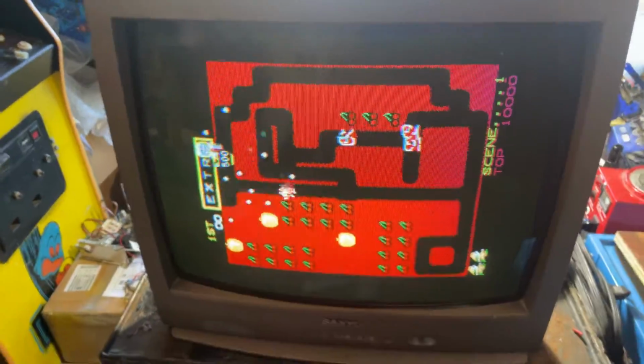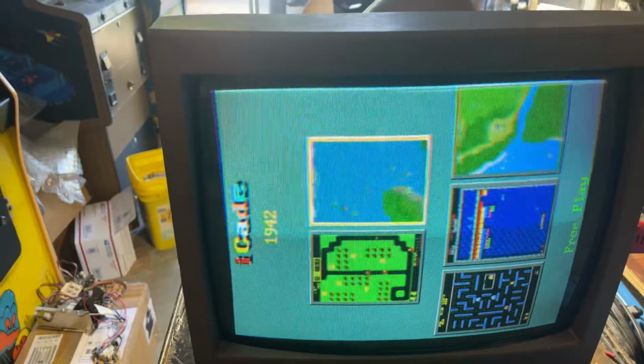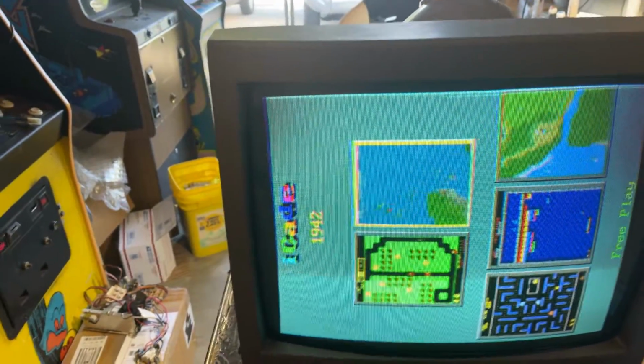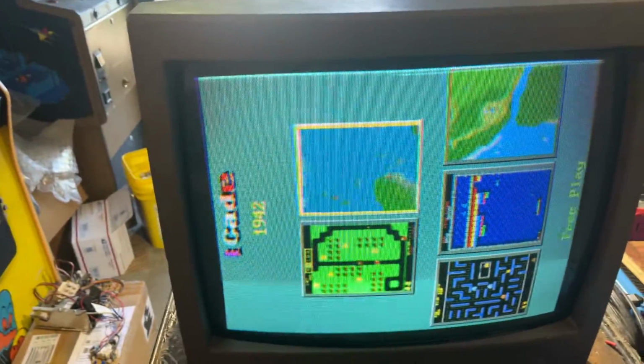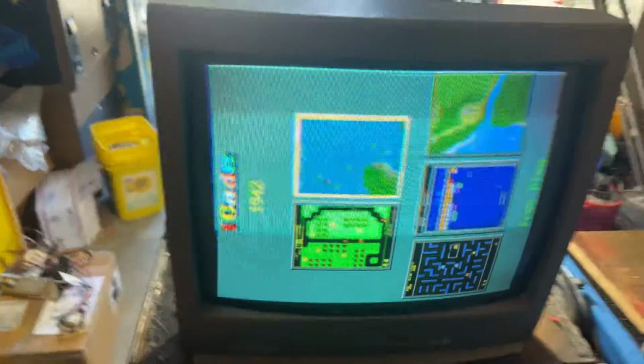The blue transistor was stuck on the main board for the colors. I replaced that, got all the colors back. It had some shrinking problems. I did the cap kit, serviced all the pots, cleared up that.